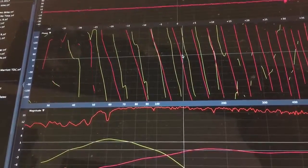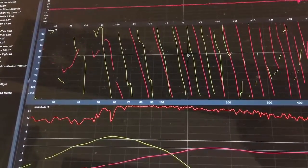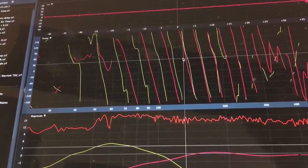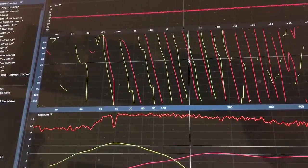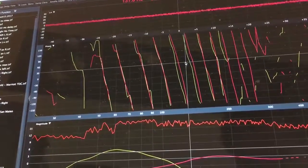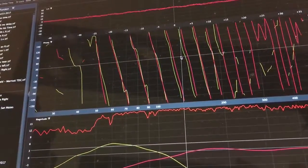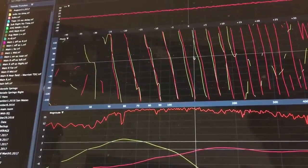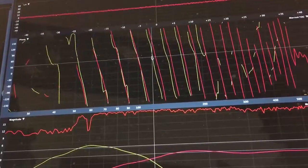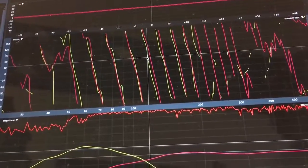I'm going to start adding delay onto those highs. You'll see that red line start folding to the left, and as I do that those lines get closer and closer to each other. Right there is six milliseconds of delay — you can see I've split the difference in between. There's 10.6, there's 11.2. As we get to about 11.2 milliseconds you can see that they're stacking up on top of each other pretty well. I don't have fine tuning on this board so it's one or the other — 10.6 or 11.2 milliseconds on my highs.